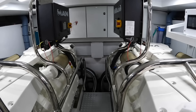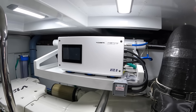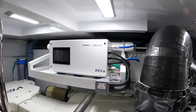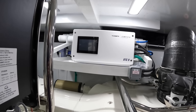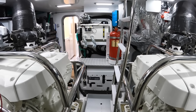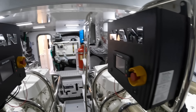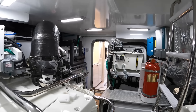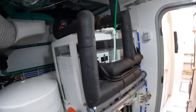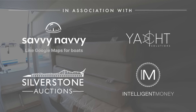Battery boxes are all in proper ventilated enclosures — not just bolted down. This is what you pay for when you buy a high-level boat like this: the level of engineering and quality that goes on behind the scenes. All the air conditioning equipment is in here — separate units for different cabins, all racked out. Big vents, engine control panels, and massive exhaust systems. You've got full-height clearance with safety bars around the engines — expensive to include, but it creates a safe working environment. Up there I believe is a seawater reverse osmosis water maker, creating fresh water from seawater so you can keep your tanks topped up without running back to shore. And finally, the sea keeper lives down underneath — let's reverse back and see it in all its glory. Fuel tanks are outboard — magnificent.